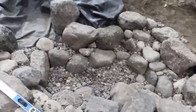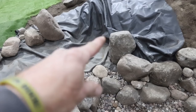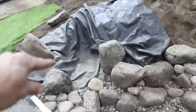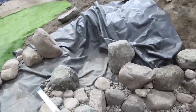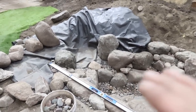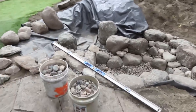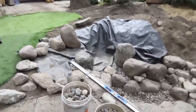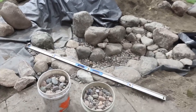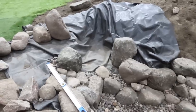All right, so we got the pond virtually completely rocked. Now it's time to start working on that waterfall. We've got one frame rock in. We're going to work on setting our spillstone and then our next frame rock. We're going to do a little bit of a beach entrance between this rock and what will be the frame rock. We're going to get the pump installed and start rinsing these rocks down as the waterfall is getting built. Once the waterfall is done, we'll do all the edges along the pond as the pond is full, then work on setting those wing wall stones and getting it landscaped so you guys can see what this would look like in somebody's actual backyard.